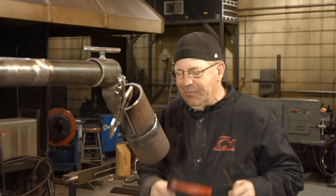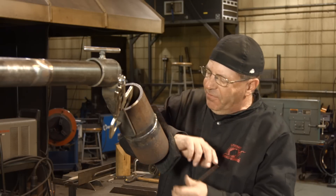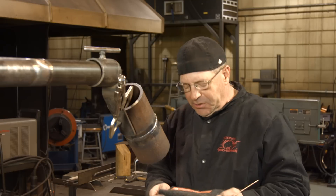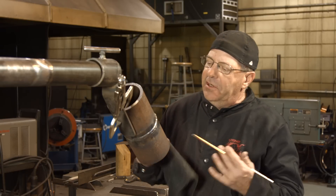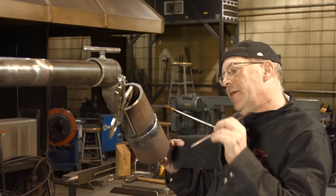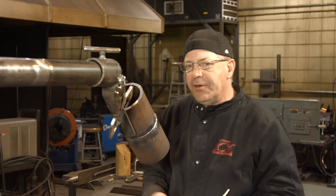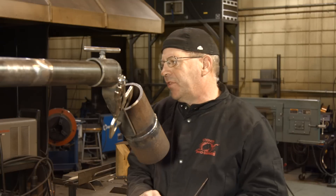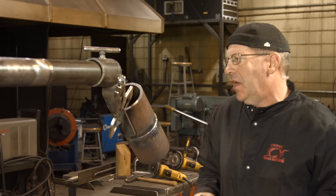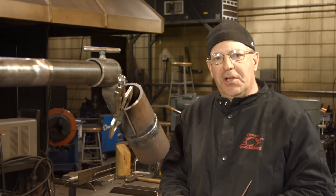I want to mention this item here — it came out real handy because I was able to rest my forearm against it. It's a Steiner Velvet Shield — no heat, pretty comfortable. I'm a little out of practice on this kind of weld, but it's doable. Watch your parameters: I was running .030 wire, 40% inductance, C25 gas, .030 ER70S6 at 17 volts. I hope this helps. Thanks for watching Weld.com — subscribe to the videos.